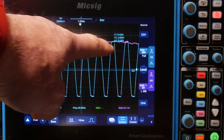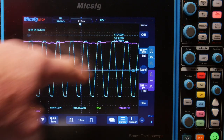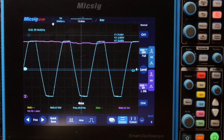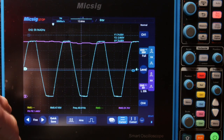See the purple line? That's the transformer — maybe some diode drops through the bridge rectifier, but that's the wave. But look at the transformer — how it's flat-topped. So the transformer itself is clipping. Now, isn't that interesting? It's almost 48 volts, so that's about 24 volts.